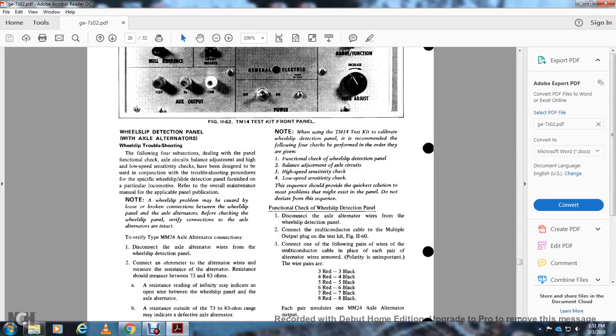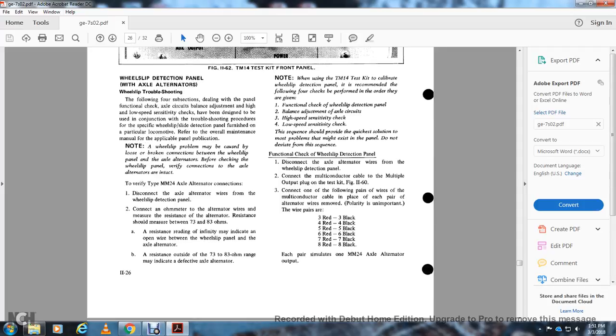Particular locomotive, refer to the overall manual with the applicable panel publication. Note the wheel slip protection problem may be caused by a loose or broken connection between the wheel slip panel and the axle alternators. For the check of the wheel slip panel, verify the connection with the axle alternators. To verify the MM24 axle alternator connection: